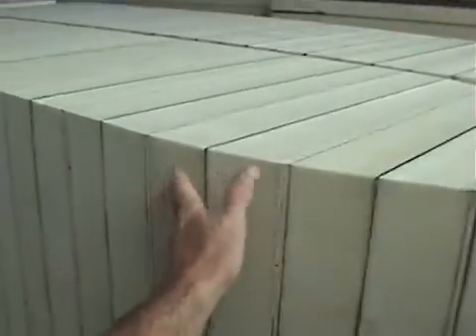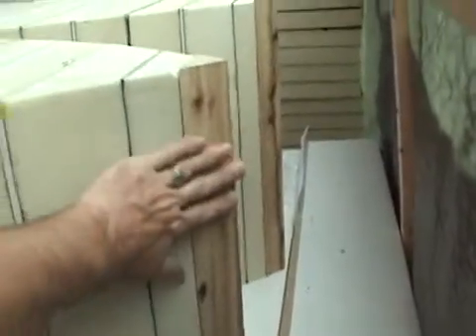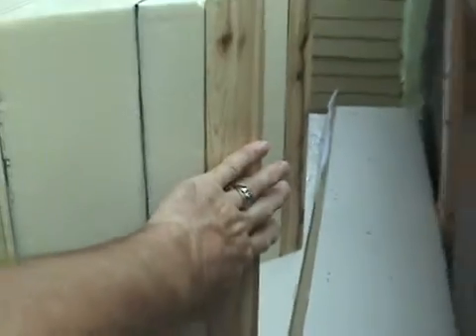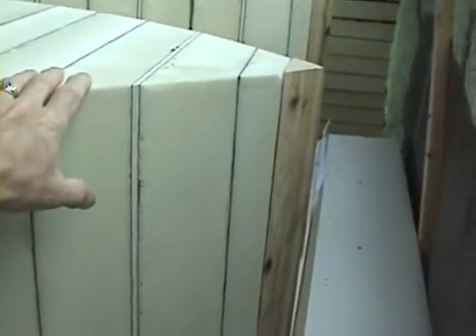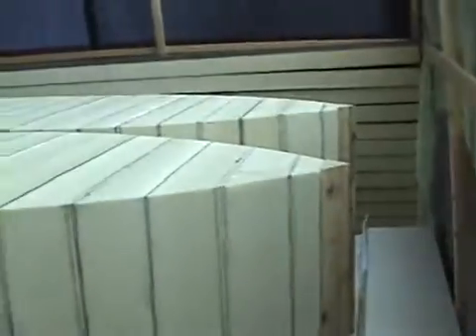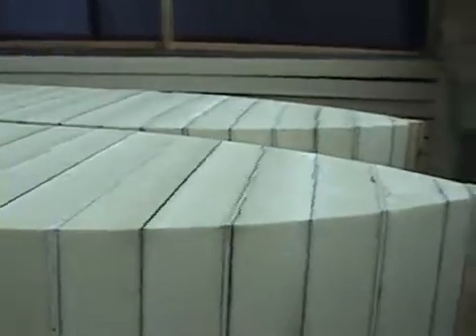Here I have my bow shape with a nose reinforcement — a piece of cedar wood that I've glued right there in the front. That's in case there's an impact or something like that, so the fiberglass will have more chances of surviving than just having foam only and the backing. Sorry for the noise of aircraft and helicopters — there's an airport right next to me here.